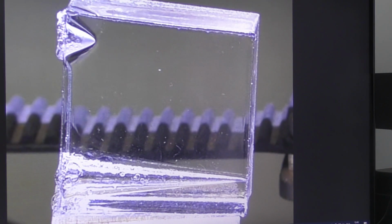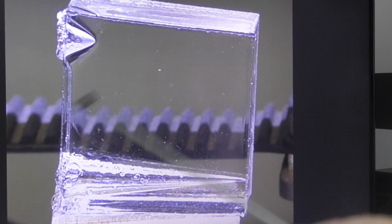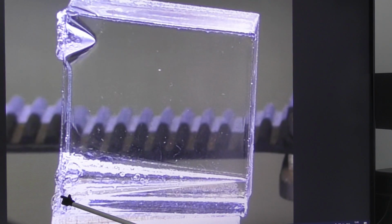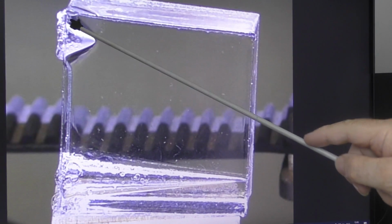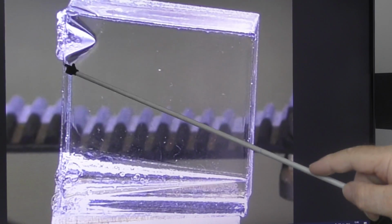And that's one of the interesting peculiarities about a glass tube. You can change the shape of the beam from sharp to blunt by changing the power. The point that I'm making there is, if you take a look here approximately, you'll see that the diameter of this beam is not much different to the diameter of this beam here. So 15% power only makes the beam blunt. It doesn't change the beam diameter. Let's compare that with the beam that I'm actually using to do this test. This beam here is much smaller diameter than the glass tube machine. And as a consequence, its intensity is much, much higher, and it was able to burn through this same 25 millimeter block in about 4 or 5 seconds, as opposed to 10 seconds. Right? So that's the influence of intensity on material damage speed.